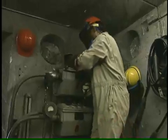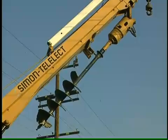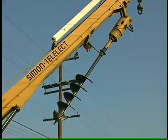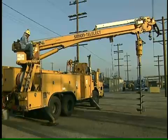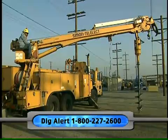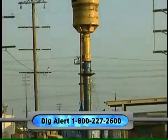You can't see underground power lines, and you don't know they're there, but power lines below can be just as dangerous as those above. Never assume that you're safe. Diggers should always call ahead of time to check for the presence of local power cables, giving advance notice by calling this toll-free number: 1-800-227-2600. Be sure to specify the exact location of the intended excavation.